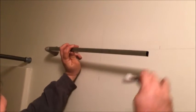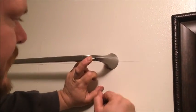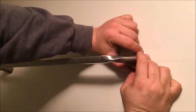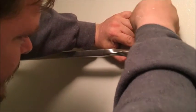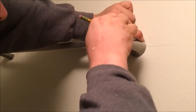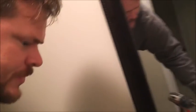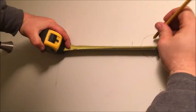I'm just gonna put this on here and let the towel bar tell me where it's going. I'm gonna eyeball where the center is as far as up and down. You might need to measure — if you have some kind of grease pencil or something you can mark this stainless steel with, find the center of it. I'm gonna draw a circle around it. Now I'm gonna measure and find the center of this circle, which is an inch — we got lucky, it's something easy. And that tells me where this crazy little bracket goes.